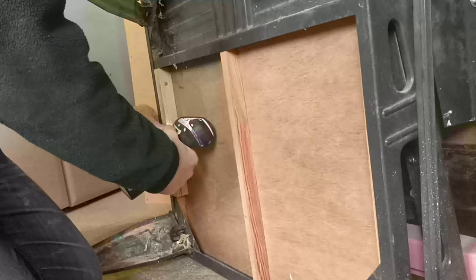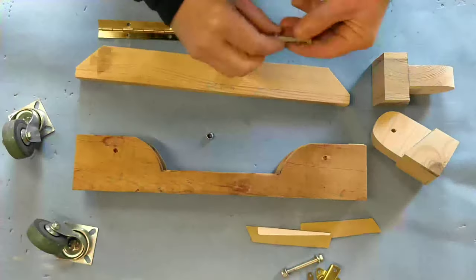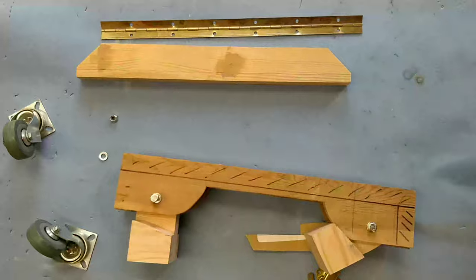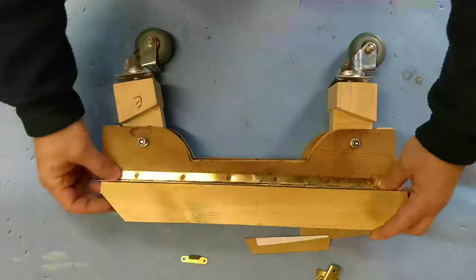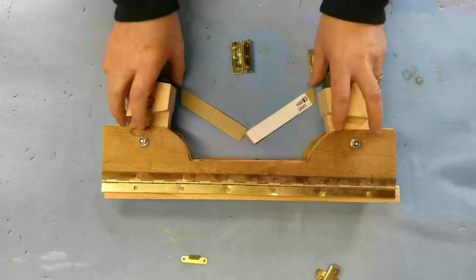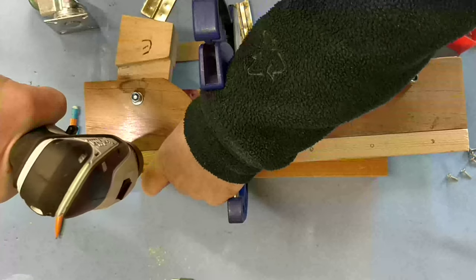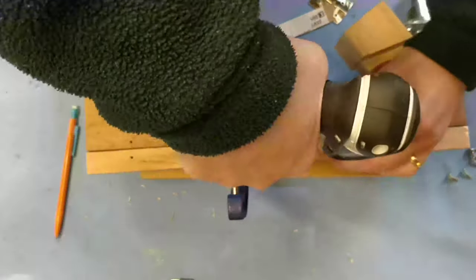This is attached to the frame of the bottom shelf on the workmate. Here I'm doing an assembly test, checking everything will work as expected — I'll cut 2x4 to replace the cardboard later. The idea is the hinged wood will push the feet apart, lowering the casters below the level of the workmate feet and thus raising it off of its legs and onto the casters. In the dry run this seemed to work fine. I marked up the positions of the screw holes on the piano hinge and drilled pilot holes. It may not be obvious yet what this hinge is for — all will become clear later.